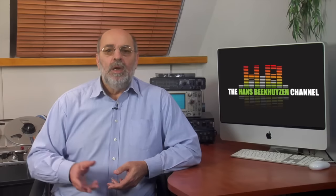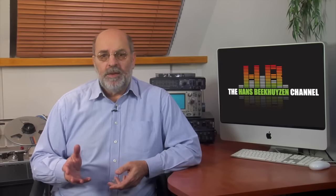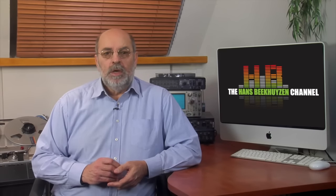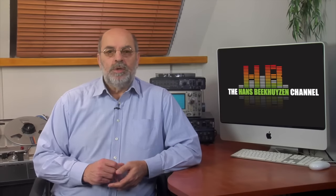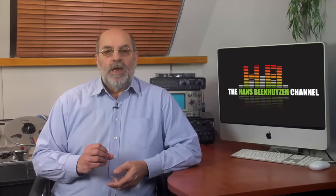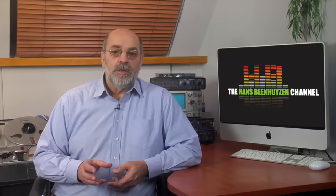The standard power supply for the Raspberry Pi is a switching power supply that, like almost all switching power supplies, generates a lot of high frequency noise. See them as variations in water pressure caused by bubbles in the water. Linear power supplies use expensive transformers, and audiophile grade ones use audiophile grade capacitors and inductors. There's no such thing as a free lunch, and in this case there probably isn't even a cheap lunch.